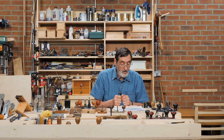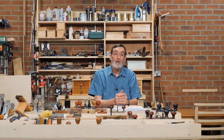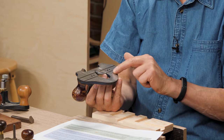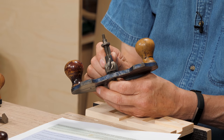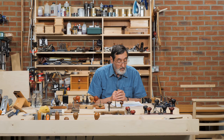Pete from Yorkshire: having just bought my first router plane, what basic maintenance should I do to restore it to a good working tool? He's actually talking about two different things — restoration and maintenance. Basically, if they come full of paint and rust and maybe some brick dust mixed in with concrete, you just have to get all that off. Take the plane, true up the sole, get it as flat as you can, break the edges all the way around with a file or abrasive paper, oil the components, clean off any rust from the moving parts and threads, and then sharpen it. It's up to you how much work you want to put into it.